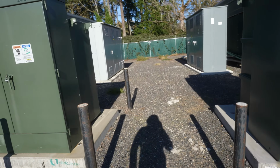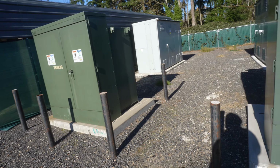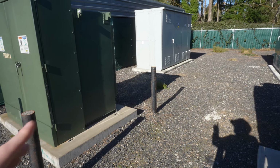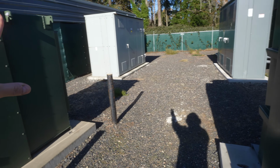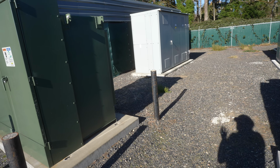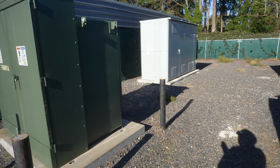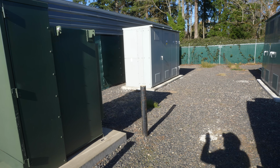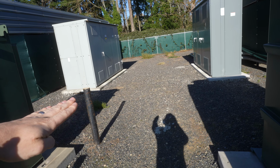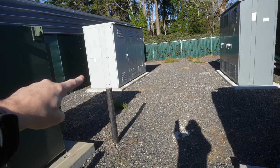Now, for the hydro solution, this is the difference here with hydro and why we are looking into hydro more than air. For hydro, you do not need that gear. Okay, gone. The gear is gone. Why? Because in the hydro solution, it comes with a 1200 amp panel. That's at 480 volts. The panel is included inside the container. So you drop your container, boom, right? Instead of that gear, you have your container. Just drop right here. That container does not require a gear, so you save that money right there.